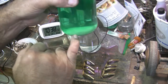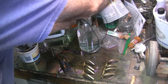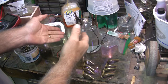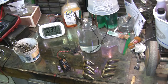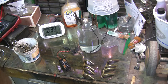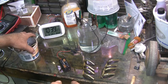You can see that buildup down in the bottom of my nickel plate solution. If you shook it up it'll get all cloudy — you could probably filter that out with a coffee filter, but it just lays on the bottom and doesn't hurt anything. But it will slow your process down because that white stuff that builds up on the plate will actually slow the electron flow. I just discovered that by mistake — it wasn't doing anything and then I flipped them around and it was bubbling away again.